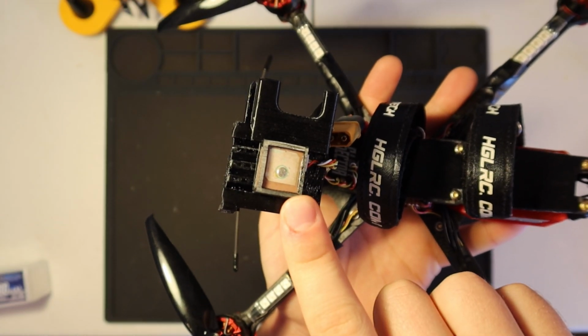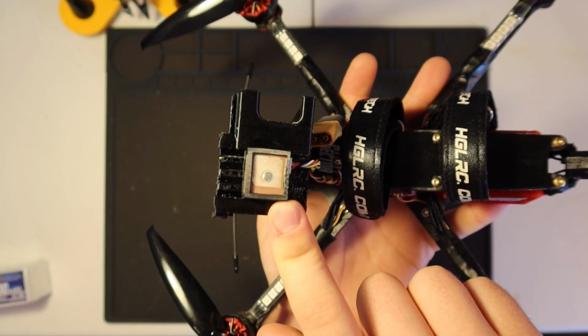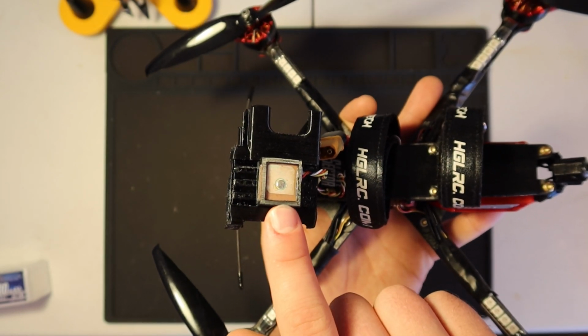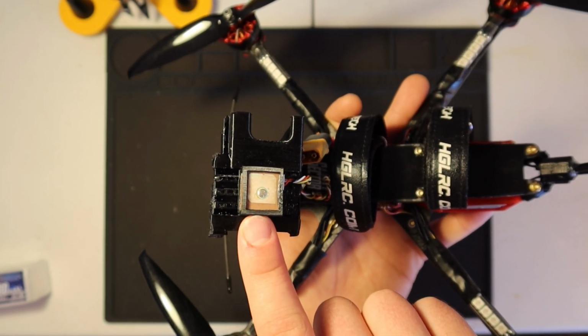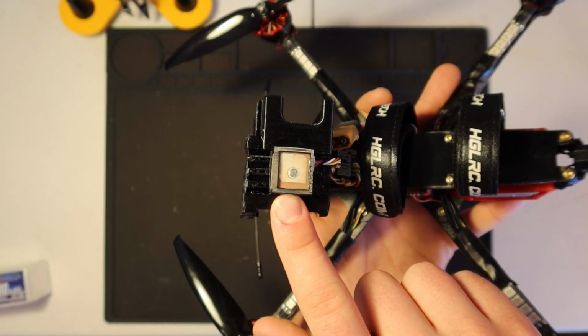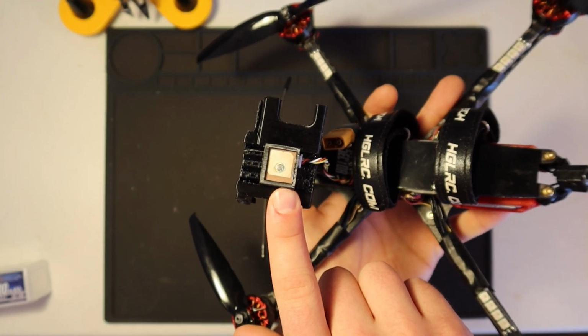This GPS module not only tells me the direction where I took off, with a little arrow on the DJI OSD, it also tells me longitude and latitude, height, and speed, and has a GPS rescue function where it will be able to autonomously fly back to the general vicinity of home.